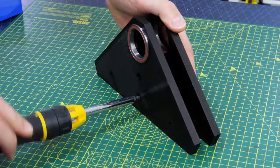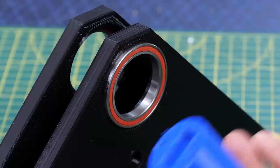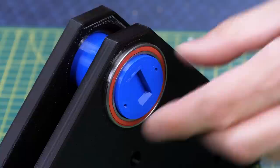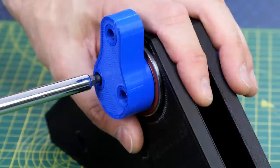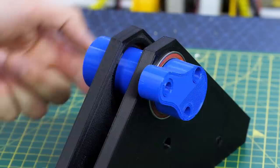We've got two sides to the build for the main chassis and each of those has a bearing inserted. Those are screwed together and there's a spacer which holds them apart as well as some other spacers. There's a barrel part that fits between those two bearings and that's got a recess in each end so that we can attach the cam, and these are the main cams that are going to drive the legs and keep them in sync.